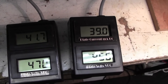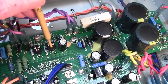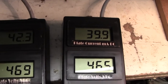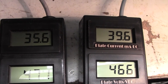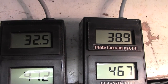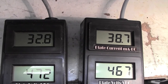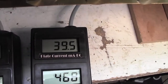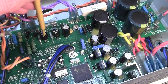So what I'm going to do is stick this trimming tool into this pot here and I'm going to turn it clockwise to reduce the current on the left-hand meter. See, I'm turning it clockwise now and that's going down. I've obviously gone a bit too far, so I'm going anti-clockwise now — I'm aiming for about 35 milliamps. That will do for the moment. The other one's at 39 so I'm going to swap to that one.